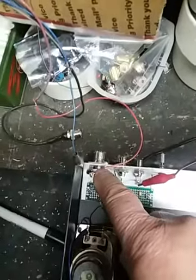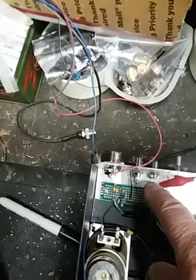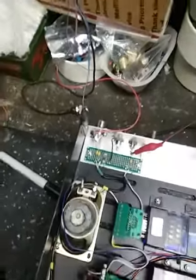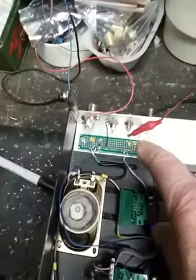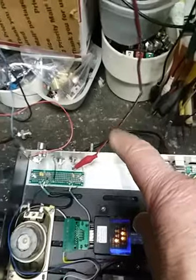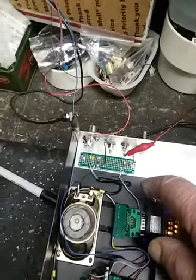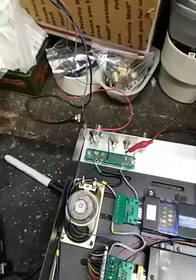Let's start in the back. We've got an HF port, an SO-239. I've got a BNC and an F-59 fitting for UHF and VHF. Right now I'm using clip leads as an antenna — I'm below ground in the basement so reception is barely there — and we're connected out to our 160-foot long wire for HF.